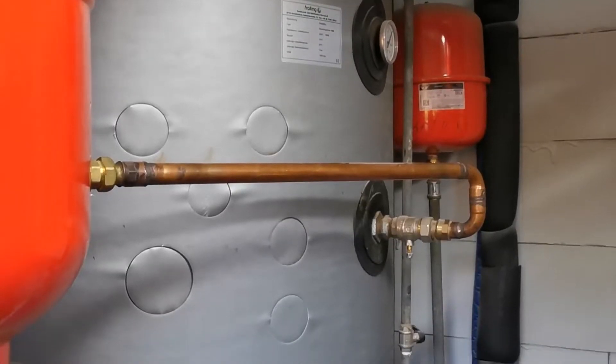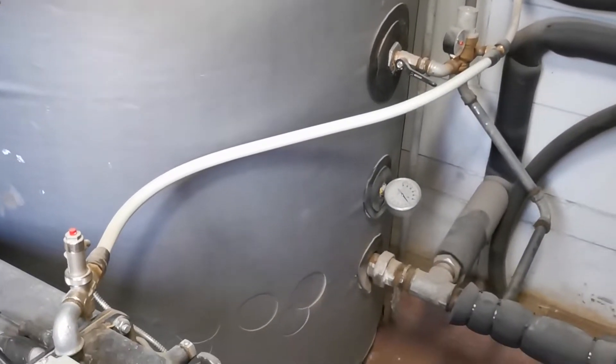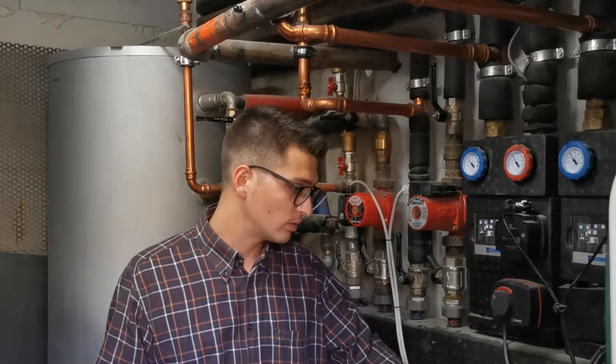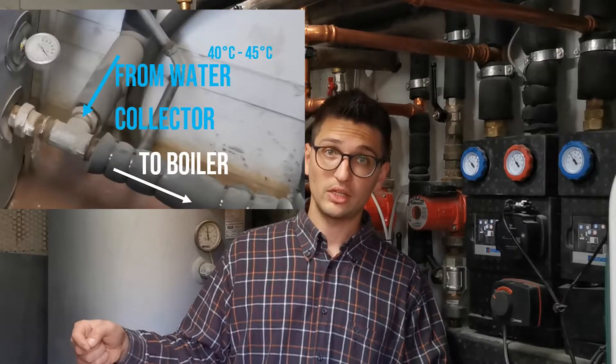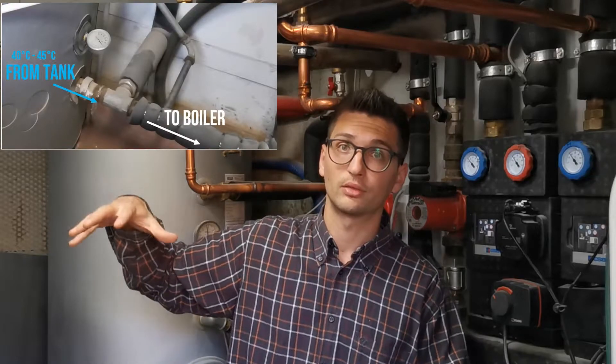The hot water goes directly into the main buffer, the water collector for the hot water. The same design is done at the bottom in the cold water circuit. The T-connector works exactly the same: if the house is heating up, the cold water returns here in this pipe and goes into the perpendicular branch of the T-connector at the bottom. If there is no water circulating, the cold water comes from the bottom part of the buffer, which I will show you next in the video.